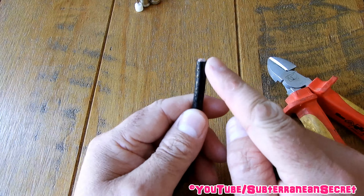Now we want to cut the inner insulation — this clear piece of plastic, or in some cases foam, which is no different. We need to be careful not to damage the inner copper core. Just gently snip into the plastic or foam a few millimetres above the actual copper core. Just gently snip around it, and once there are enough cuts in it, just gently twist it either clockwise or anti-clockwise and it should come off.